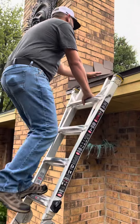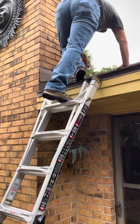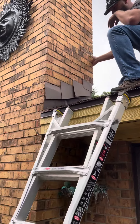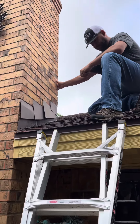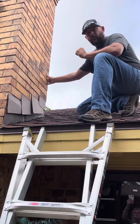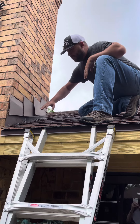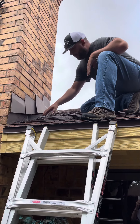Look at Chris, he's going up on top of the roof. We are going to talk to you today about roofs and leaking around the fireplace. I noticed on a couple of home inspections, Chris, we have gotten banged on this. What is this about? Yes ma'am, this is a super critical issue for water penetration — the flashing around your fireplace. This is made to divert water around your fireplace.